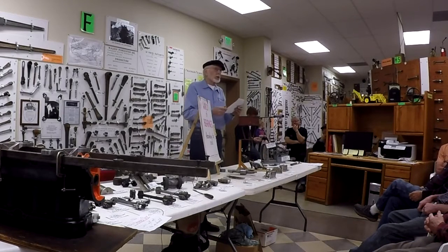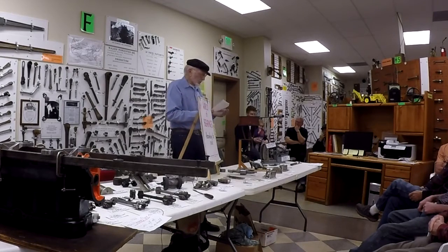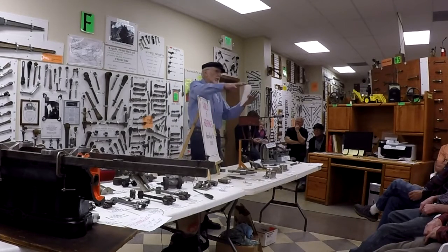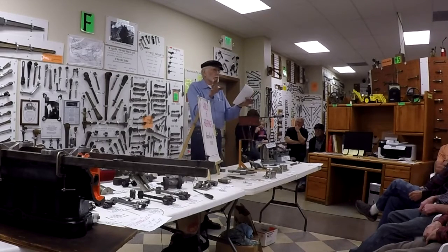If it's too slow, the stream can cool off going through air. You don't get enough force to fill, and so it'll stop again. It piles up. If the pour is too cold, the Babbitt itself is too cold, it'll start down in there and just freeze over. Or if you do get enough of it down in there, it may not be hot enough to transfer into the back or the cap or the block and either bond or fill into the anchor holes. And that's important.